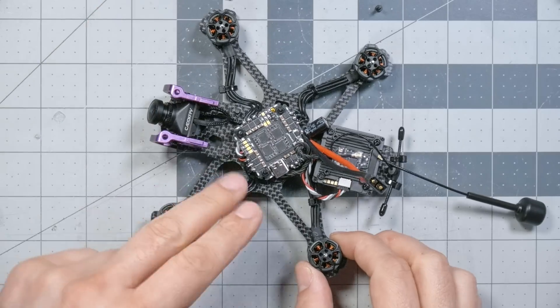In this video, we're going to do what I call buttoning up the build — that's where you put the top plate on, mount the antenna, and do those last-minute little assembly things you've been putting off. This is an intentional choice, saving the buttoning up until after all the flight controller configuration and testing. It's super frustrating to build the whole quadcopter, put the top plate on, and then find out during Betaflight setup that you wired the receiver wrong and have to tear the whole thing apart.